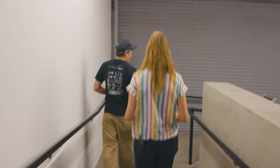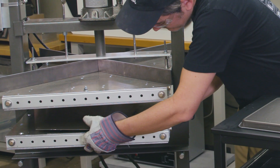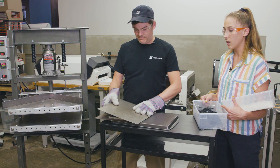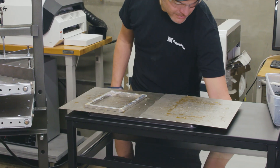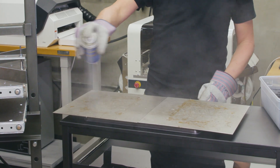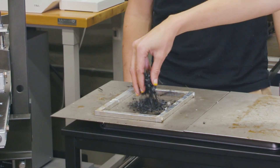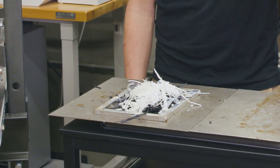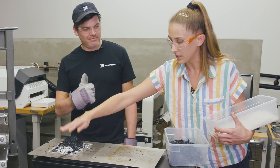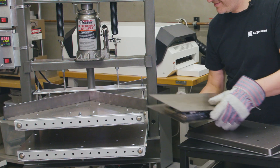We've preheated the press, and now we're going to walk you through a quick demo of how the heat press operates. Bruce is going to pull out our roll of thinner sheets of steel here that are acting as a sort of liner and tray for our material. We're going to spray some mold release, which will help our plastic come off cleanly once it's cooled. This is just a simple frame we've built here at the lab. And now we're going to load our plastic — remember you want to sort of overfill so that you have enough to squish down into that form. And now we're ready to put this plastic-steel sandwich back into our press.